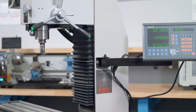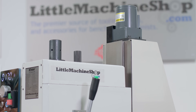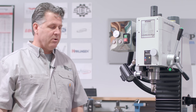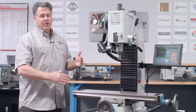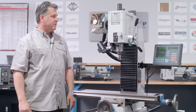This is a very solid, rigid column — not a tilting column or a tilting head. Introducing a tilting column or head offers some nice features like angle cuts, but they also introduce a constant issue of the machine being out of tram. So we've decided to make sure this is a very rigid, solid machine. If you want to tilt, a sine vice or other solutions can handle your cuts.